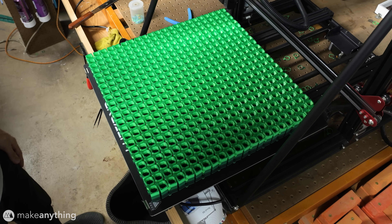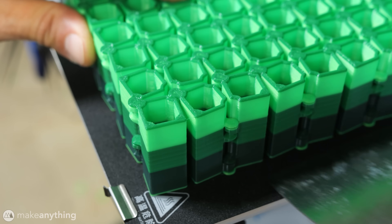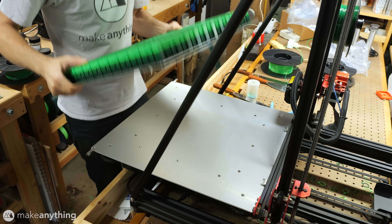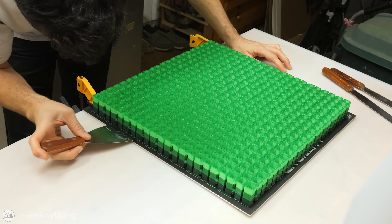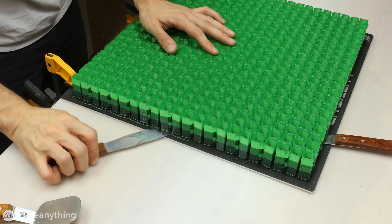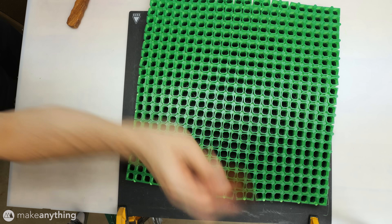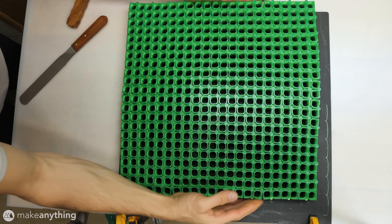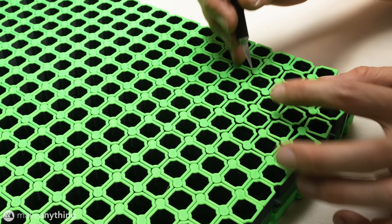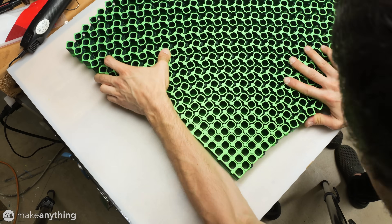Still, that wasn't the end of it, because I needed to successfully remove this enormous print from the print bed, and as many of you may know, build tack beds like this can have quite the gripping force. So I ended up clamping the bed down to my workbench, and carefully working my way around this print with several spatulas, separating it little by little like some futuristic archaeologist. Even after removing the print, the hinges were still a bit stiff due to stringiness in the print, so I had to do some cleanup with the heat gun and the exacto knife, and I just slowly worked the hinges back and forth, little by little, until the hundreds of hinges all got smoothed out enough to complete the full range of motion.